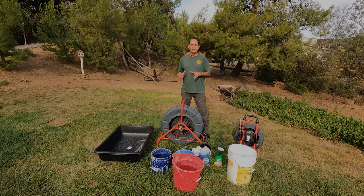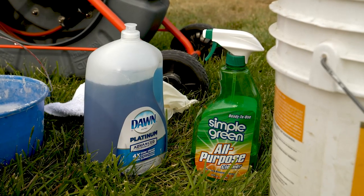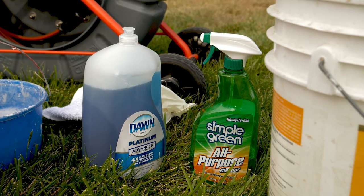These reels are easy to clean but there are a few things you want to avoid. The reels are sealed against environmental moisture but they're not designed to withstand pressurized water, so don't spray them off at the hose and definitely don't use a pressure washer. When choosing a cleaning product, don't use anything harsh — harsh chemicals can attack the seals, so dish soap and water are your best friends here.